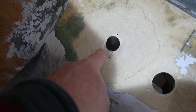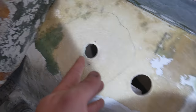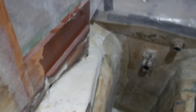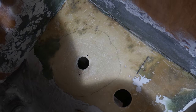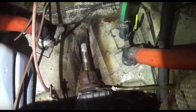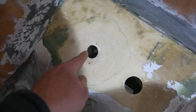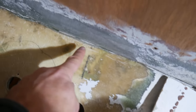There are a couple of small jobs in the engine room to help prepare for the beneath-the-waterline work. The first is this through hole here which I want to close up - I think this was for the original Volvo Penta engine where the water inlet was at the back, but with the Yanmar the water pump is right at the front. You've got this long line running all the way to the back, and then you have to reach up and over the engine and the big dry riser to get your hand there - really awkward. So I'm going to move that forward. First up is to close up this through hole. I found some delaminated tabbing around here as well, so I've opened that up and I'm going to tab back here.